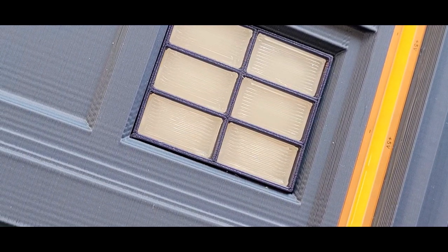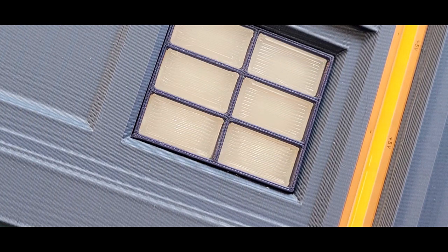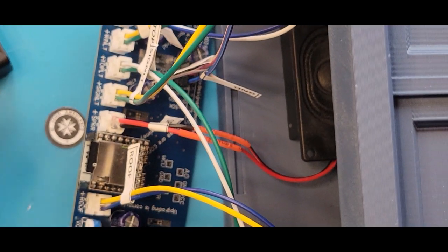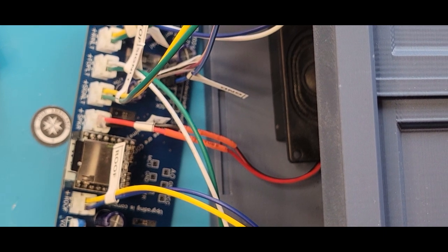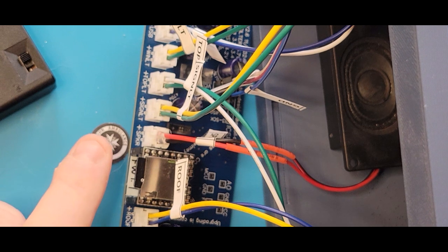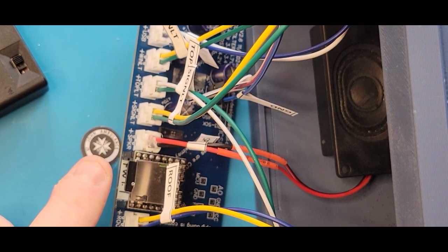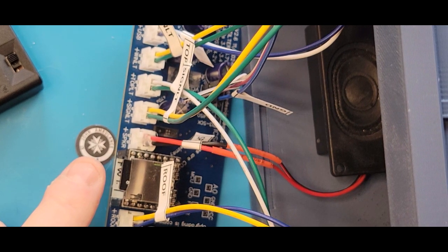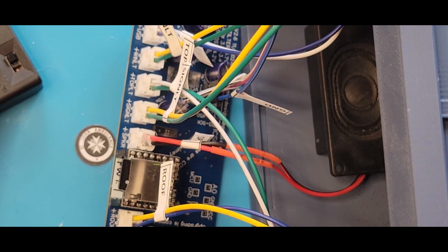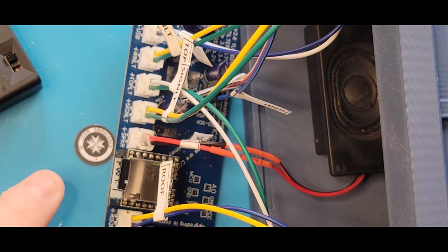No, nothing happened. The reason nothing happened is because it's very power efficient, and it's got those capacitors on there. And even when I turn off the battery box, the capacitors still hold charge. And because the board is so efficient when it's in standby mode like that, waiting to be triggered by the touch sensor or replacing the lid, even with the battery box off, it still takes several minutes for it to drain that voltage from the capacitors.